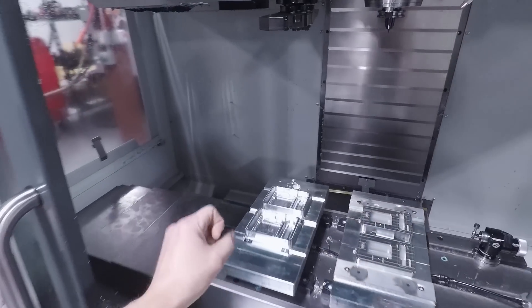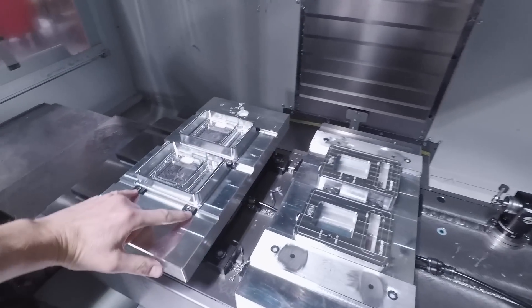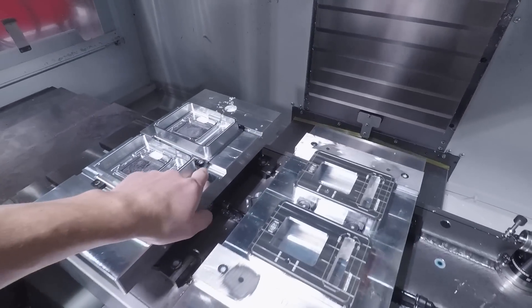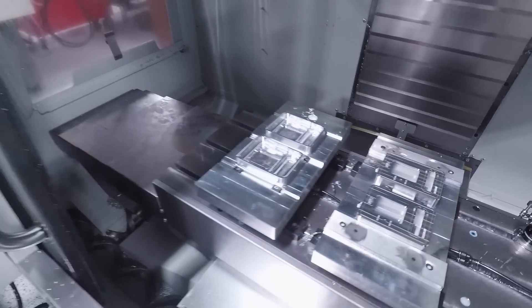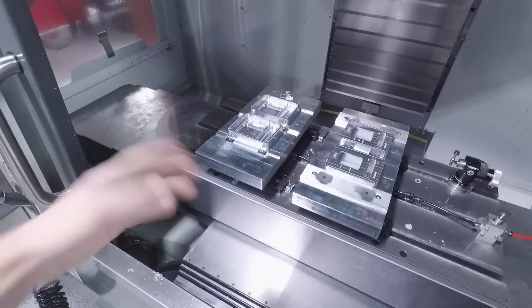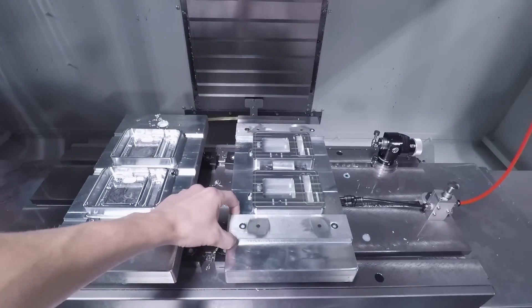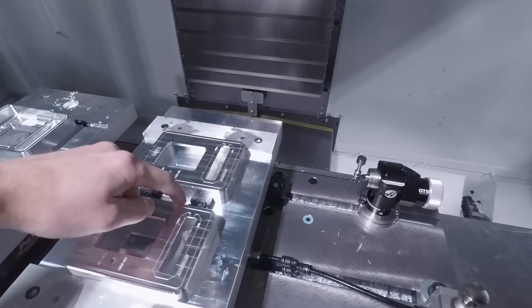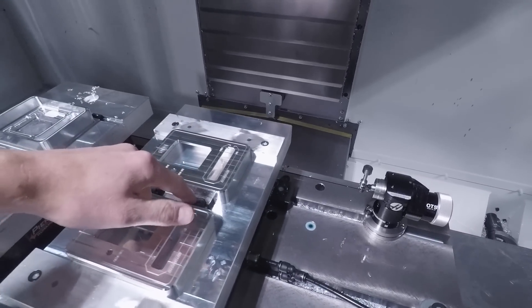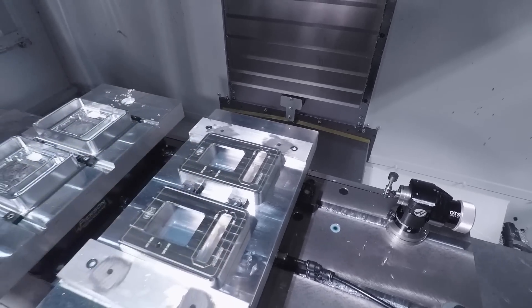More to come on that — I think I've got an article already. The material comes literally right up to the machine. We're using the Pierson Systems with Talon Grips and Pitbulls, which gives us a pretty low-profile hold. Then they get flipped over to just this riser bar with a pin, and then these are Carr Lane — they're called Tiny Vices. We love these; you could use Uniforces as well.